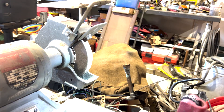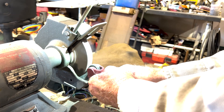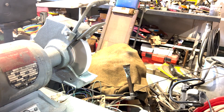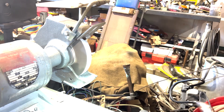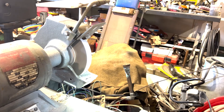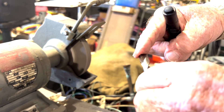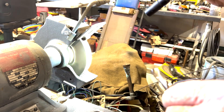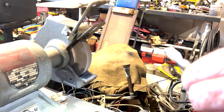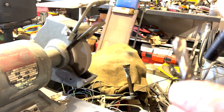Make sure that wheel is good and flat. You want to have some water there so you can dip the bit in to keep it cool. I'm gonna put that drill up there, square this edge up to the face of the grinding wheel, get the cutting edge on it, then just drop my hand - push it in, drop that hand, and that'll cut the relief on the back.